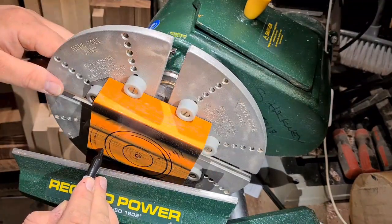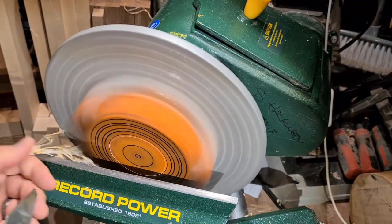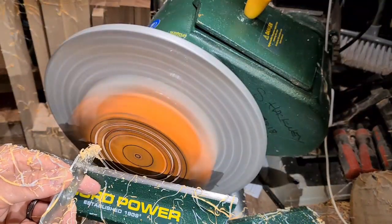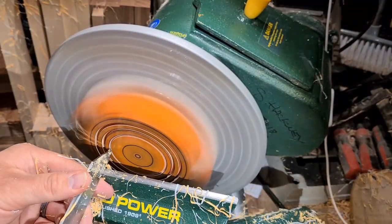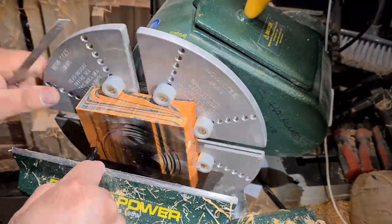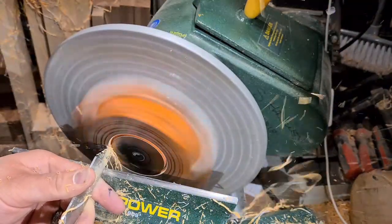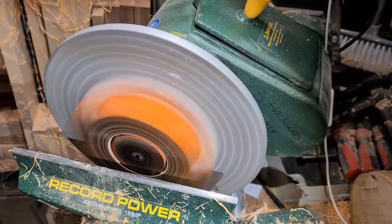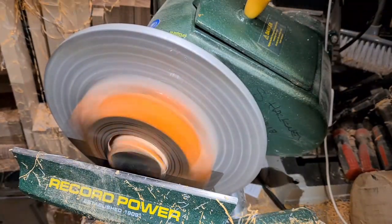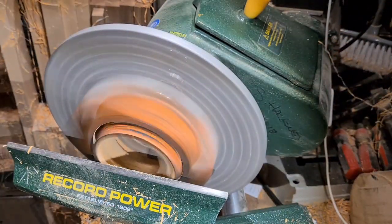Just marking out some of the starting rings that we plan to get from this. Now heading in with a Robert Sorby thin parting tool, just working down as deep as we can, heading for about halfway through the block. Just flipped it round after getting as far as possible from one side, quick mark out of where the rings were. Now we're going to head back through and release the blocks from the lathe — they come out surprisingly easily, just drop forwards. There you go, switch the lathe off and out she comes. Repeat again — now we're taking the third core out.